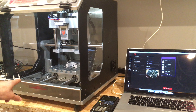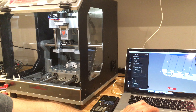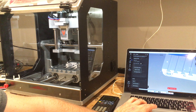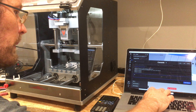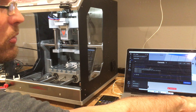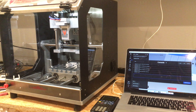Safety cover is open — even though it's very clearly closed right now. A lot of times when you're moving steppers faster they lose torque. Let's come back and look at a warm-up routine. We'll launch the debug console and see if it'll let us move without homing. Let's do G1 X plus 200 at F100 — 100 mm/min, it'll just move for two minutes.